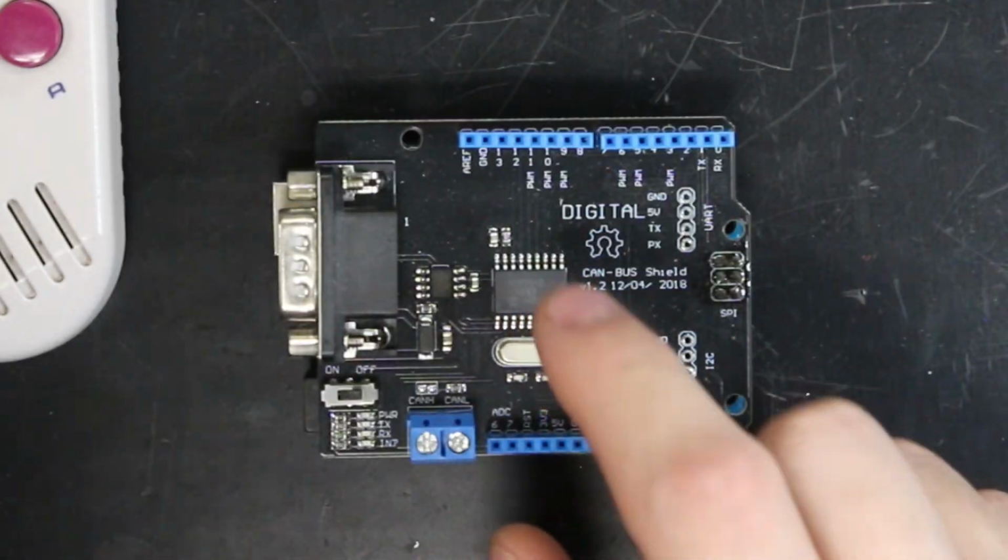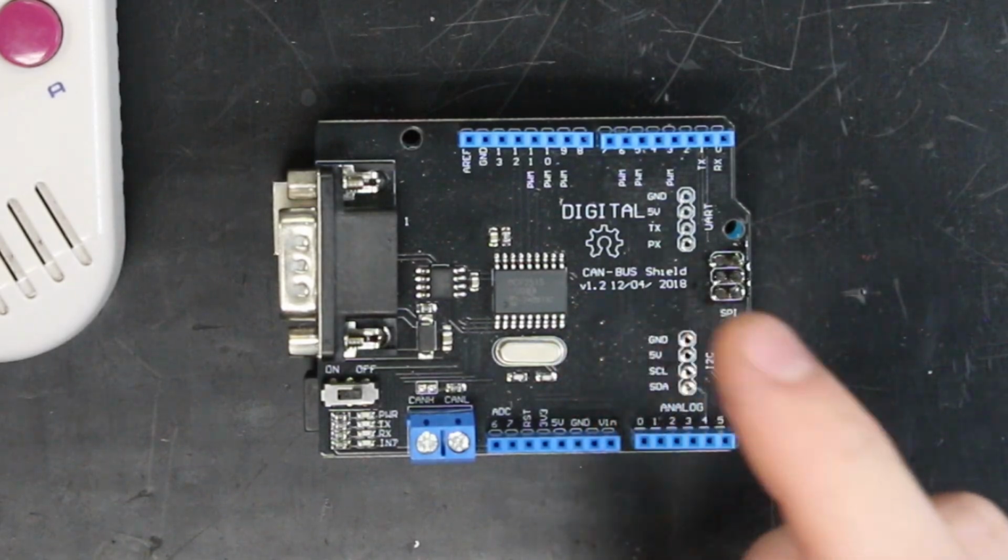Another reason I chose the Arduino is that there are plenty of libraries out there capable of driving this MCP2515 CAN transceiver chip. This should make things super straightforward to interface with our CAN bus, parsing packets with CAN ID 0A0, decoding our speed data from the 5th byte of that packet, and sending everything over to our Game Boy control board over that 8-bit port.